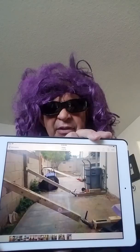So slowly, over about a week period, we had recently gotten some rain, so the ground was somewhat soft. It wasn't real dry. I suppose you would saturate the ground on both sides of the foundation if you could. And slowly, with the 4x4s pressed up against it, giving it a wide pressing area, you press it, you push it all together, not in one location.